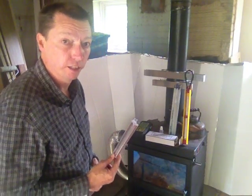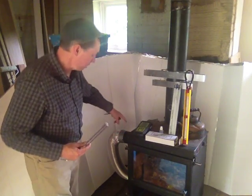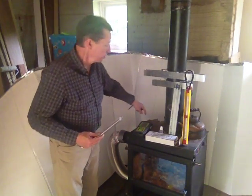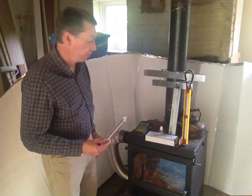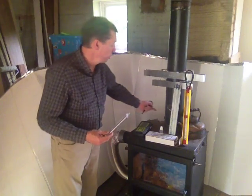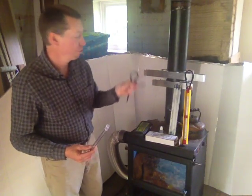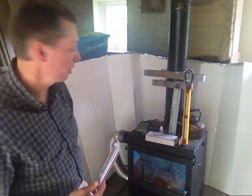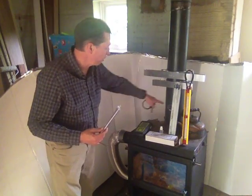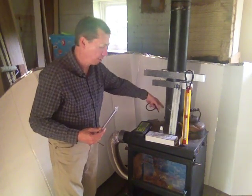The wood burner I've got here — you can see it's got a pipe on the side, that's my outside air, and in my flue I've got a hole in the side here. If this was a conventional wood burner using the air in the room, all you'd need to do is put the one pipe in there — they give you a little metal tube that goes inside — and that'll give you your draft. If you have a fire that uses outside air, you now need to measure across your fire between your inlet and your outlet.